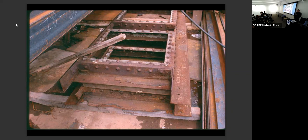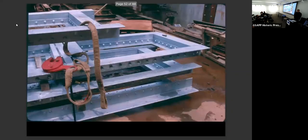The big issue for these was not replacing those angles. It was figuring out how to fasten these together so that you look just like the original riveted pieces. And what we did, see that little rivet up in the corner there? We stick a rivet through the visible portion so you can see the visible rivet head, and then in the back, they tack weld a little weld in the back to hold the pieces together. So the rivet was basically not riveted the way they were riveted, but just welded on the rear face where it wasn't visible.